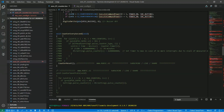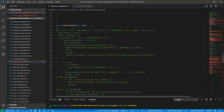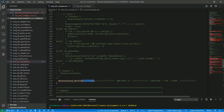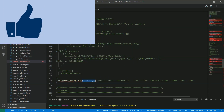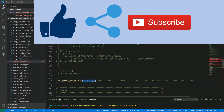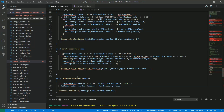In the counter every-second function, comment out all lines or delete them as we only need counter reset, which we have to add. Comment out counter save state as we have nothing to save. We will also modify counter show as we have nothing important to display or report back. The free procedures and functions below may also be omitted, as I have found no use for them in this Tuya shutter module.